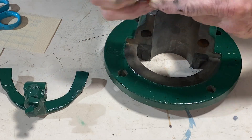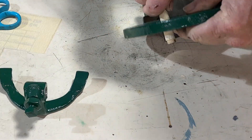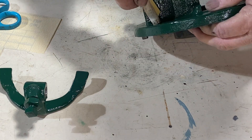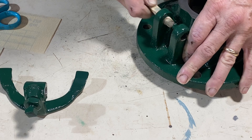Most all the parts have been painted and it was time to clean up the overspray and remove any paint from inside machined or mechanical surfaces. I used 220 and 400 grit sandpaper and a birch dowel. A little lacquer thinner here and there and a Scotch-Brite pad finished the job.